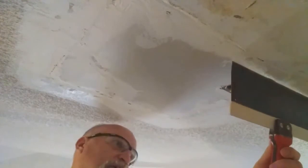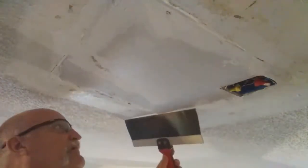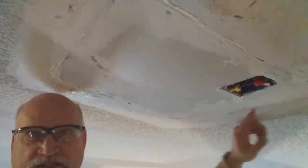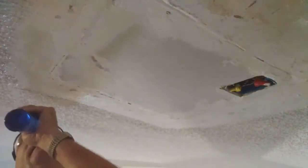And I've already done that, my friends, and I've actually drawn some lines on the ceiling here. As you maybe can see, you can see some lines over here. And right here, you're seeing the seam, okay? So we want to feather it out. So basically, my friends, I'm just going to take my little atomizer bottle, a mist bottle, and I'm just going to soak down out to that line. Just make a square patch, that's fine, my friends.